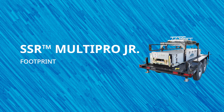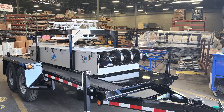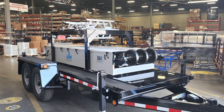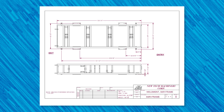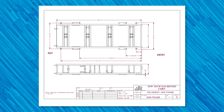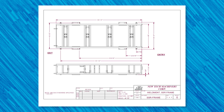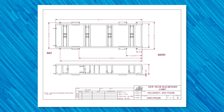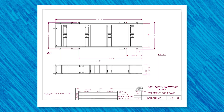Finally, let's talk about the SSR machine's footprint. This is important so you can understand the towing requirements, overhead lifting requirements, the space the machine can take up on a job site, or its dimensions if you want to mount the machine in your shop or install it on your own trailer. Without a trailer, the SSR weighs 1,715 pounds, is 12 feet 6 inches long, 3 feet 10 inches wide, 4 feet 3 inches tall with the overhead reel rack, and 1 foot 10 inches tall without the overhead reel rack.